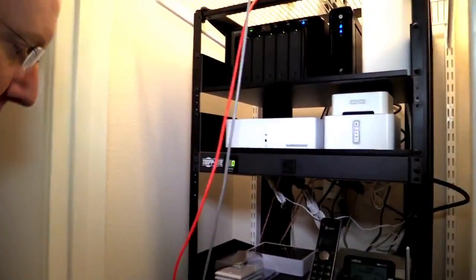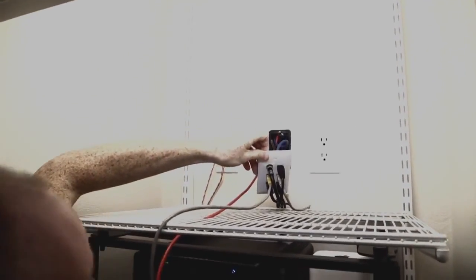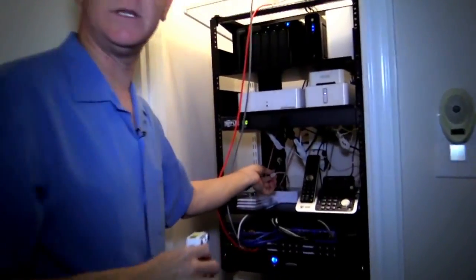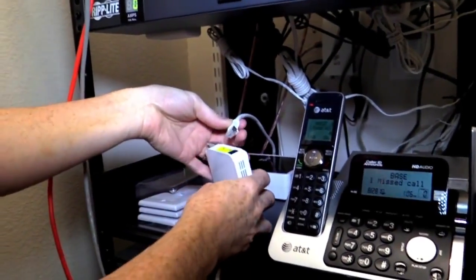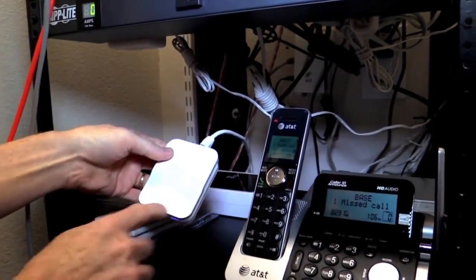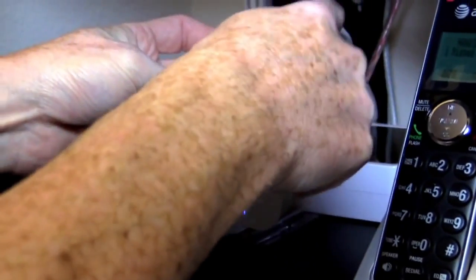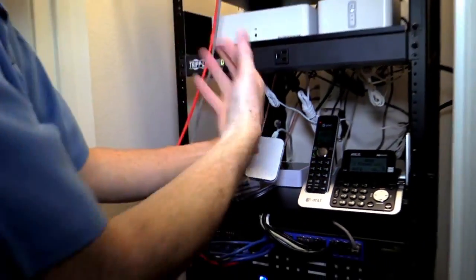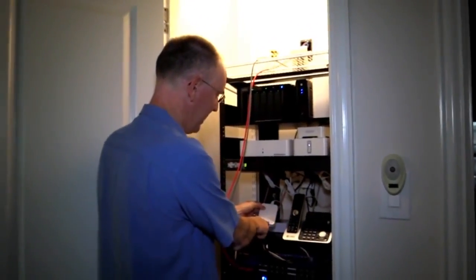My install is not complete so it's a little messy. There are two wires right here coming out from power, going up to a little jack panel. I've run out of jacks because I have too much ethernet, so I'll add another one later. These cables go up into the attic carrying power to other access points in the house. I also have a white one going right up onto this shelf — I just plug it into the 12-volt power over ethernet port and it turns on. No power cable needed, because the power is coming from the POE injector.